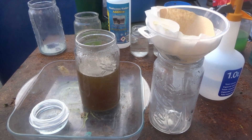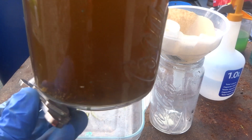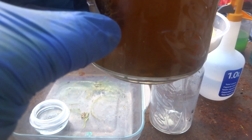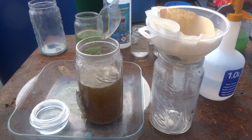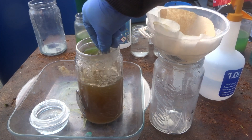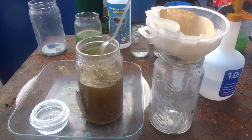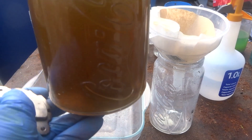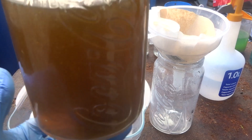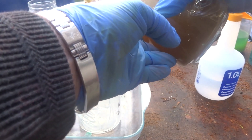Here are the ceramic CPU pins — still a good lot of base metals in there, as you can see with the magnet. But there is gold floating around. What I'm going to do is filter out the freed gold flakes. You can see the gold there floating around — all the gold flakes which have been freed from the base metals. I'll use the magnet to hold the base metals while I filter out the gold flakes, and then check if there's still gold on those base metals and put them back in if so.